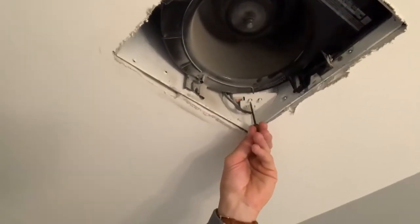This other dial is for the time delay. So when you turn this fan off, it's going to keep running at full speed, and you can set the time delay from as low as five minutes all the way up to — I believe usually 60 minutes on this particular Broan-style fan. I'm going to jump down to the basement real quick and just show you the fresh air intake damper that this works in conjunction with.